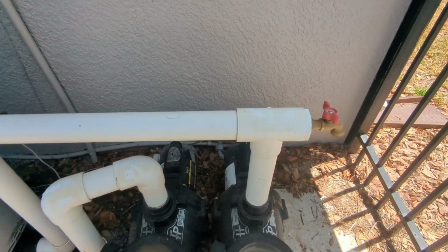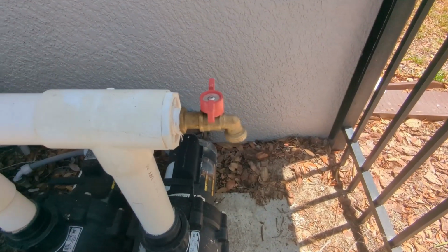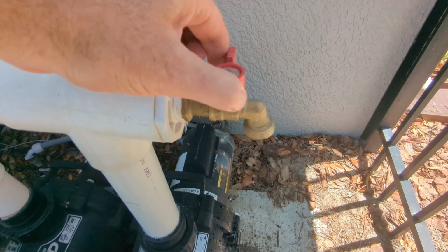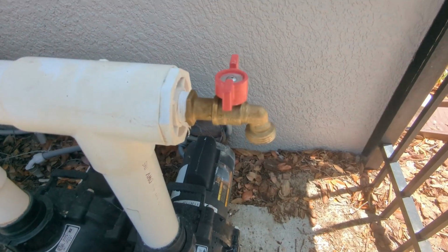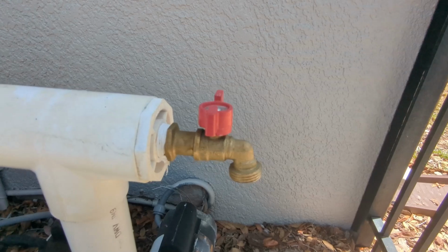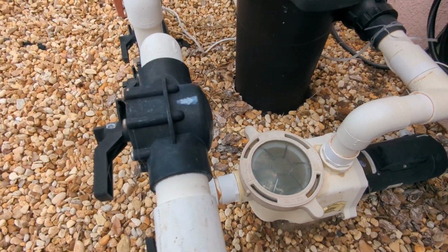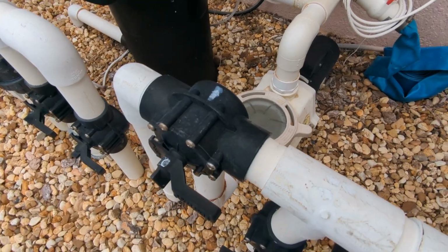And sometimes a regular spigot is used for the discharge. While not as common as the ball valve, it's still useful. Simply attach a normal garden hose and open up the spigot to release the water and drain the pool as much as needed. Different valves can be used in combination. This is the three-way valve with a few two-way valves.